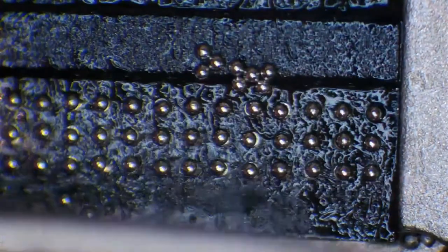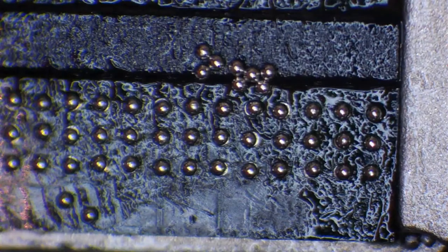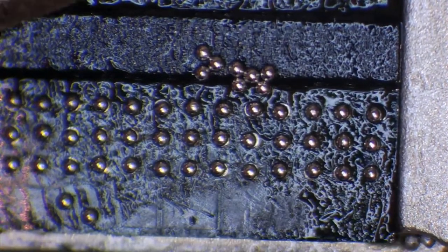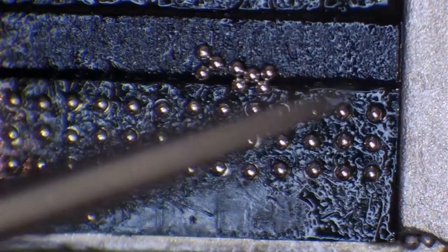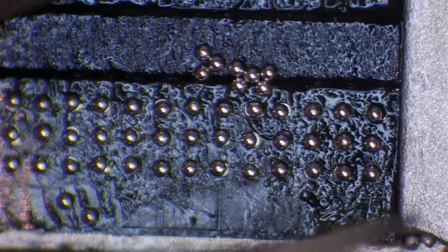So if I've got the tweezers like this, I'll bend them outwards, so they're stretched out and further apart in the natural position. The reason I'll do that is because if you're using just one tweezer, the other tweezer's not going to get in the way as much. The other tweezer should always be above the tweezer that you're using to move them into position. However, sometimes it is going to get in your way.